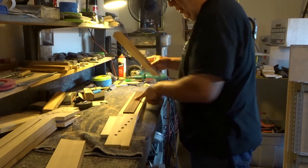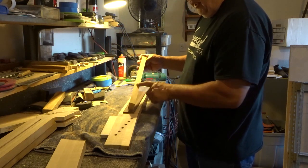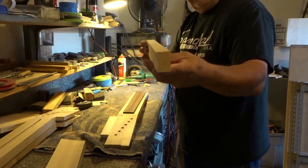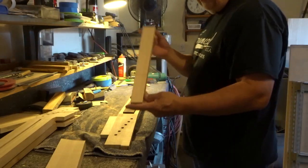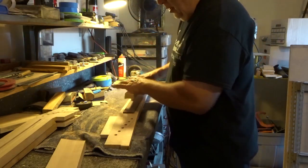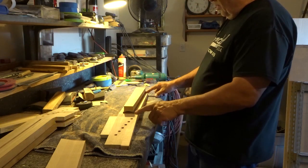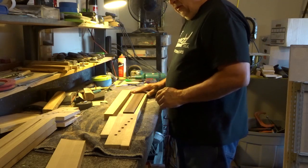When you put your glue block on, you can ultimately glue it to the fingerboard. This glue block is pretty thick — about an inch thick — so it won't flex and it's pretty straight. It's also tapered: it's narrower here and wider down here to accommodate the width of the nut area at the back end. It's also not quite the full length of the fingerboard.